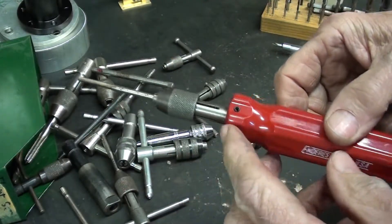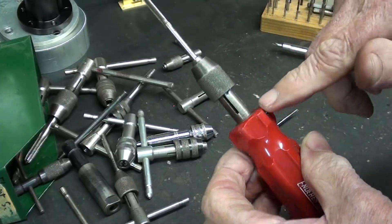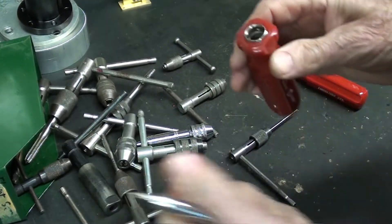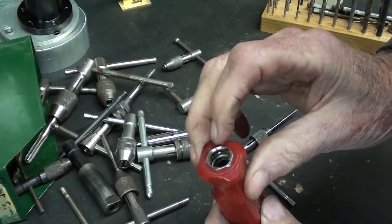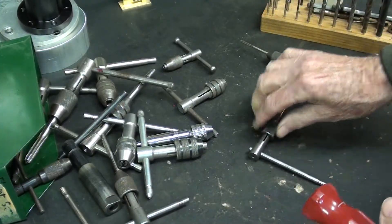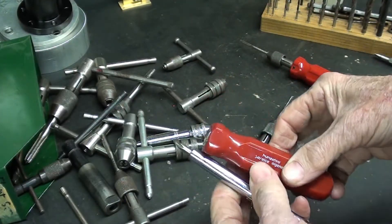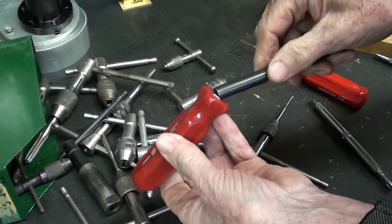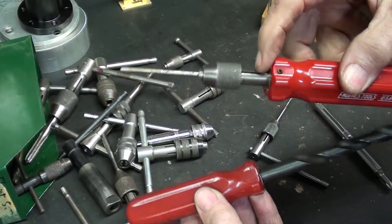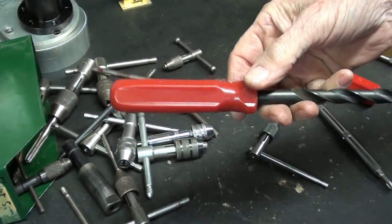So how did I go about doing this? There's just a little bit of machining, and then the tap wrench is pinned with an eighth-inch roll pin through the handle. If you look at one of these, it has a metal liner. The diameter that I needed to turn right here was 7/16ths — but yours is going to vary depending on what you start with. This is a 7/16ths drill bit, and as you can see it fits in there, so that is the diameter that I turned this down to. It might be a little tricky for you to hold this, so I'm not going to turn another one down, but I'm going to show you how to hold it in your lathe, and it will work very well.